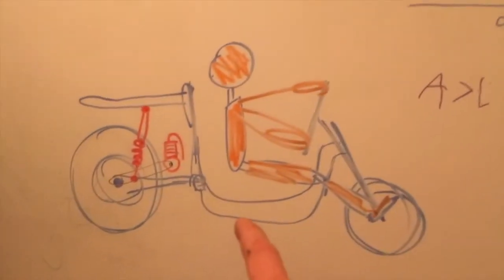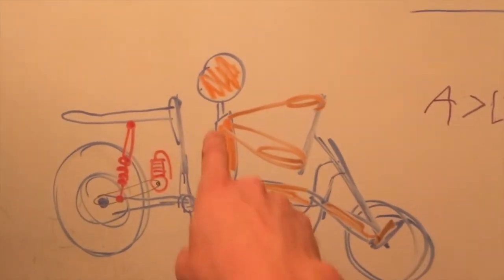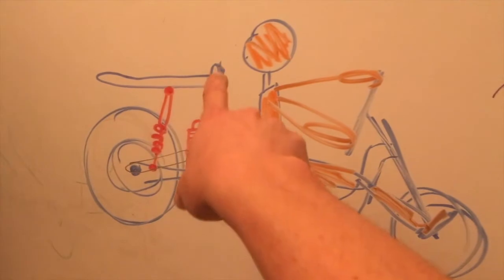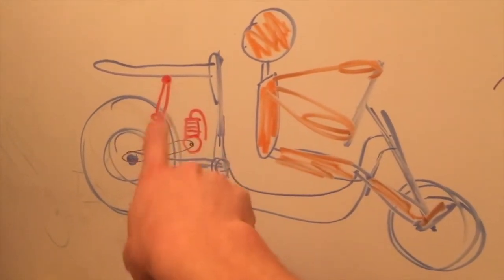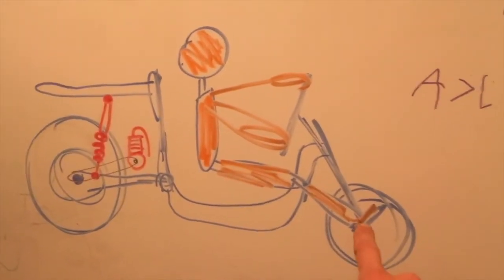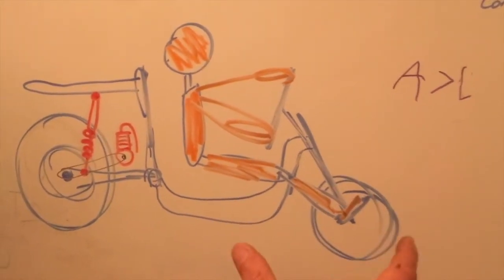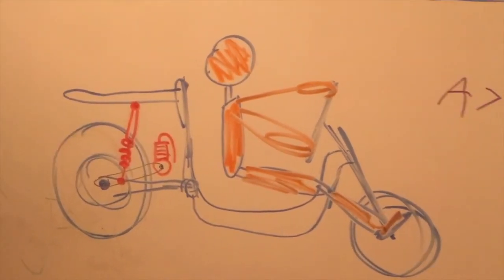Okay, so use my whiteboard here. This is kind of what I'm going for with this new motorcycle. So again, if you notice the really reclined position, it's going to be a recumbent motorcycle. And so here's my frame. Kind of comes like this. Kind of comes up here. I'm going to have to build this part out. There's my swing arm right there. There's the rear shock. And there's me sitting there. There's the handlebars. And you can see my feet actually come next to the front wheel. But it's a smaller wheel. And so when I turn side to side, without having my feet too wide, I'll actually be able to have a pretty good turning radius on this motorcycle.